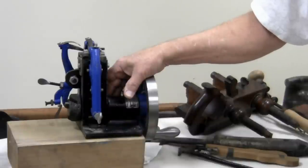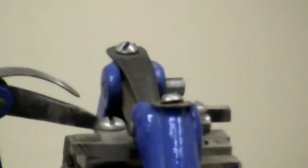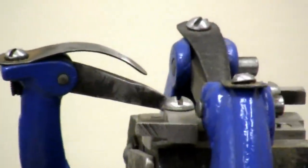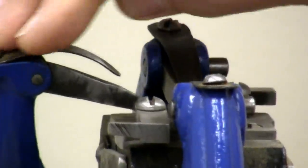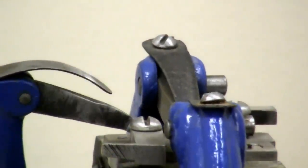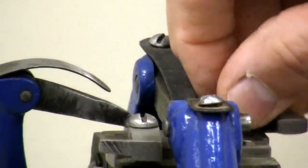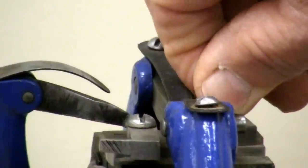If you could get a close-up of it, as you turn the crank, it has an arm that advances the bandsaw blade, and then it has a, you might call it a set or a handle on each side. There's the advance. It sets the teeth. The two sets. And it is adjustable. I didn't have a bandsaw blade that was suitable to use in that today, so I didn't bring a bandsaw blade to go in.